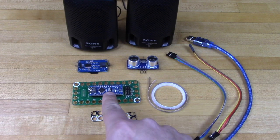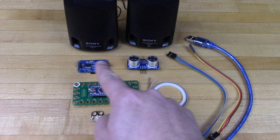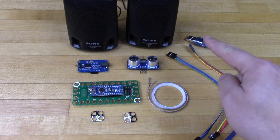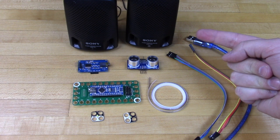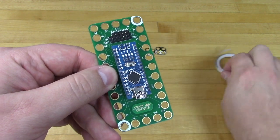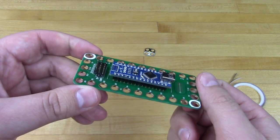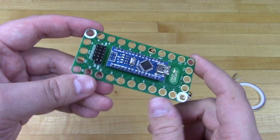The hard part is finished. Hooking up electronics is really easy. To do this, we're going to be using our Crazy Circuits robotics board, a couple of LEGO-compatible LEDs, some conductive nylon tape, a $7 MP3 player board we got off Amazon, and an ultrasonic rangefinder so the entire thing is motion activated — mostly so we can annoy other people when they walk by. They're all hooked together via some female-to-female jumper cables, and we have a couple of little tiny old Sony speakers we're using for audio output. Our Crazy Circuits robotics board is basically an Arduino Nano on a nice breakout board with pin headers on the rear end. We've got LEGO-compatible holes on the side which we'll be using to connect to the conductive nylon tape, which then connects to the small LEDs we're going to be putting on the bottom side of the LEGO X-Wing. The pin headers on the back end make it really easy to hook up your rangefinder and your MP3 player without having to run conductive tape all over the place.